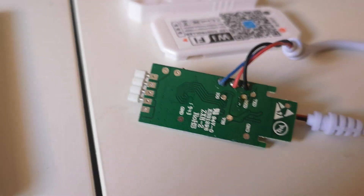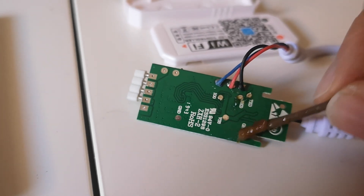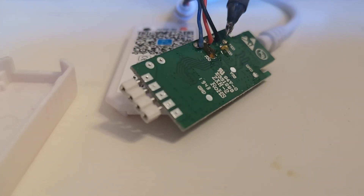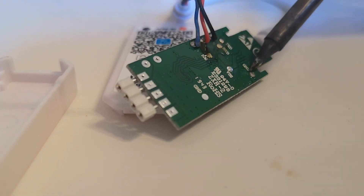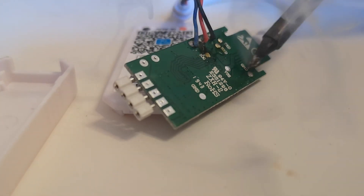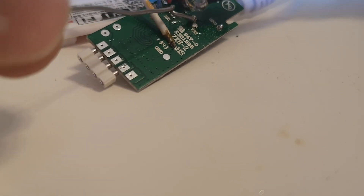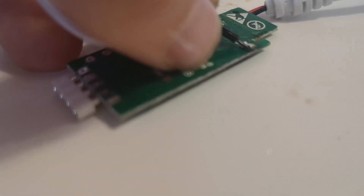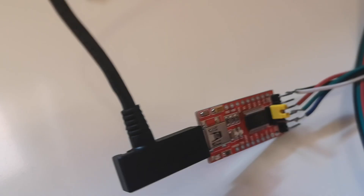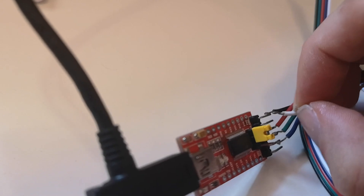Here I'm just preparing the board with some flux to make it easier for the solder to adhere, then adding a little bit of solder to prep the pad. Then just solder each wire in turn — here I'm doing the 3.3 volts and the ground. You don't have to worry about a really good job on these because you're going to be removing them after the flash. Once done, I'm grounding GPIO zero by connecting it to the ground pin.